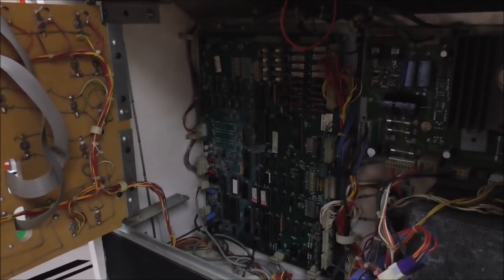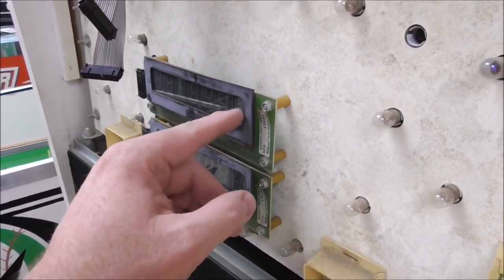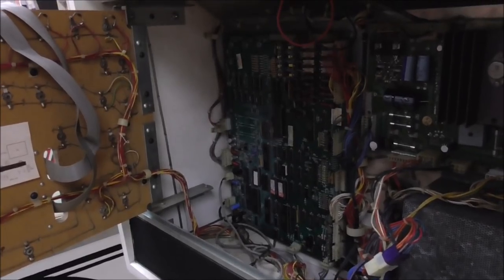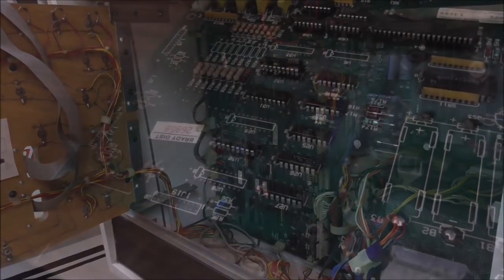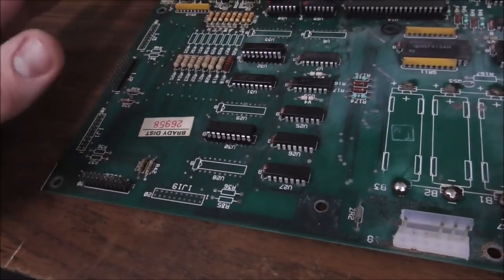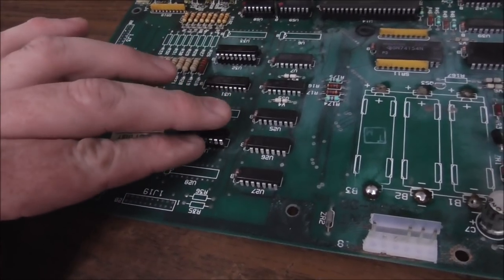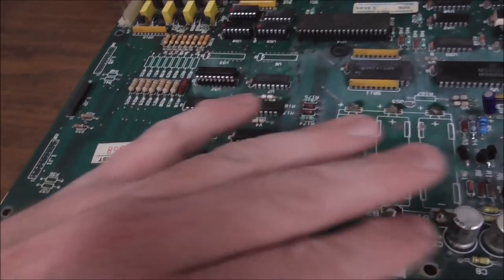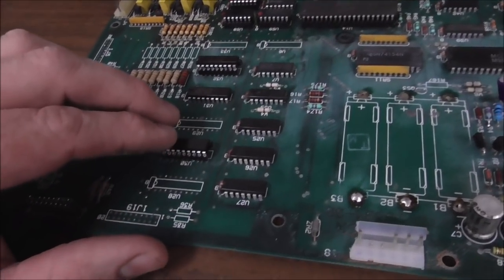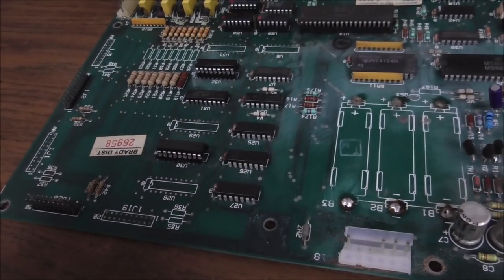Here's the kicker — you can't use LEDs in this machine. Nobody's ever designed an LED board that will work on these. The display setup is only used on this one game, and the LED replacement displays don't work the same way. They use a different master display board that System 8 does not. So we kind of have to fix this board; we don't really have any alternative. What the display was doing is just one display had one digit lighting up and a couple segments were gone.